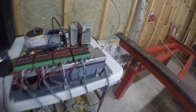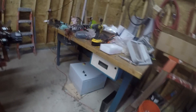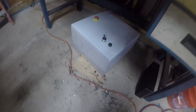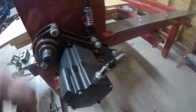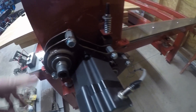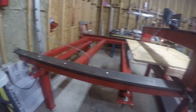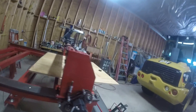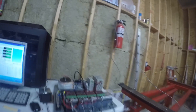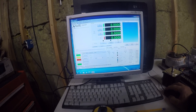I'm still wiring up some more stuff, then I'm going to put this in a box — I've got a big box over here. I need to add the e-stop and everything, but right now I wired it up, put the motors in, wired up the connectors. I just had to see the thing work after about a year of fooling around with it. I still need to finish it — I don't have the Z drive made yet; I'll probably just buy one off eBay. It does work using Mach 4, which is really difficult because there's not a lot of information available, but the unit does jog.